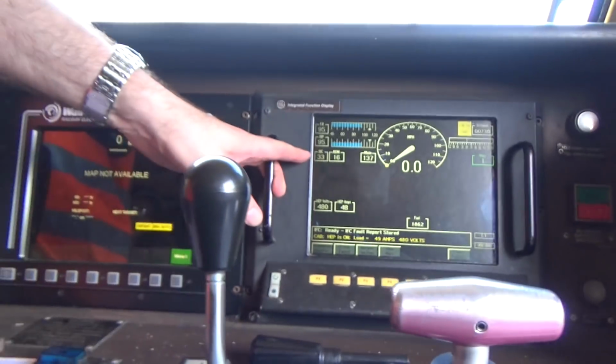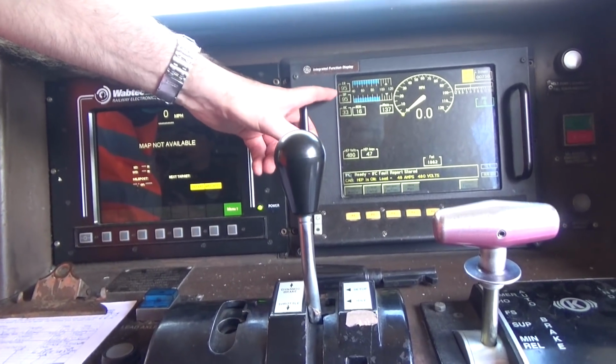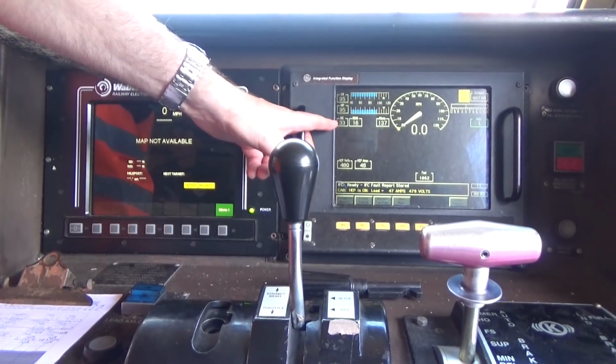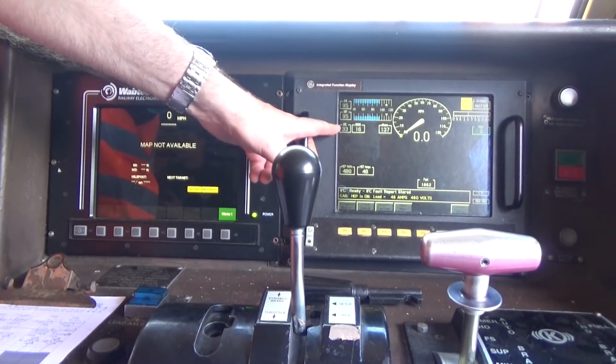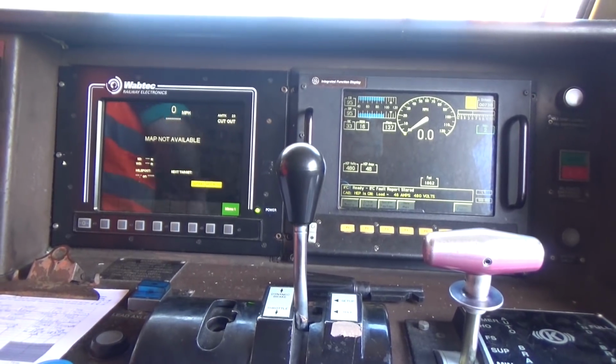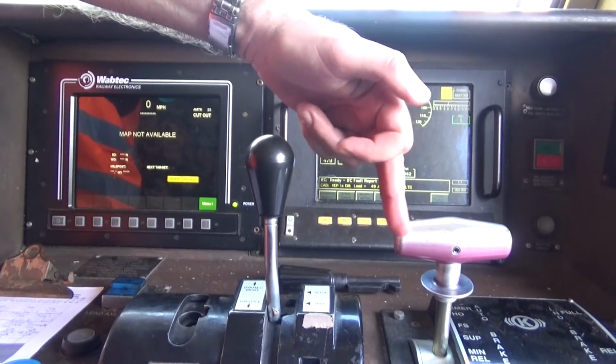All right, as we move down the railroad, usually for every, so it's 50, we took about 15 pounds out. We got about 33 pounds in. So it's like about 2 pounds for every 1 pound of reduction that I make. But sometimes when I'm running a train, I want to handle my train different. I don't want the brakes to apply on the engine. So what we can do, independently, is release the brakes on the engine.